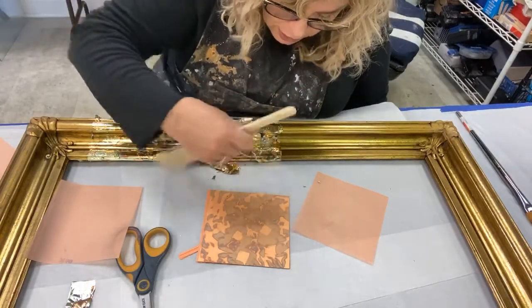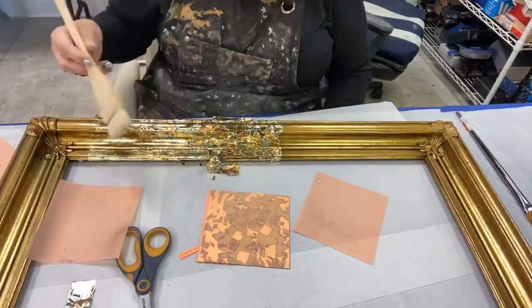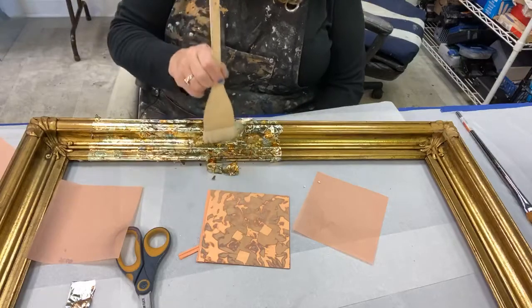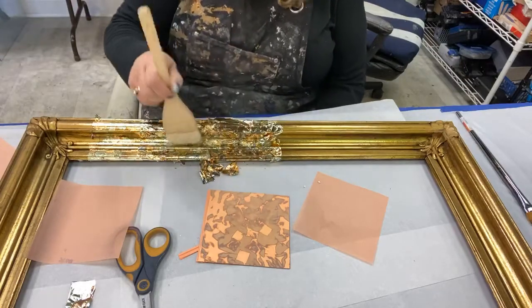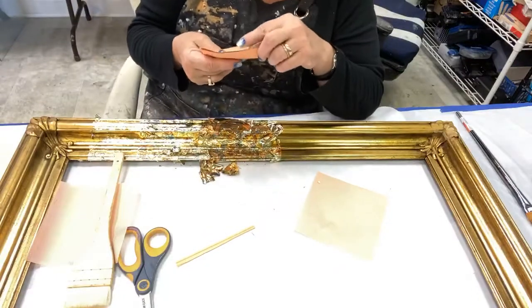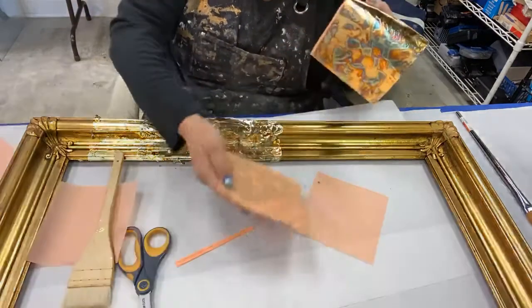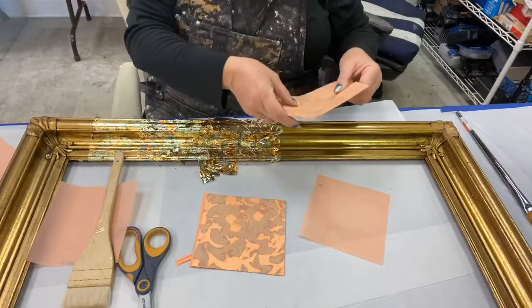So I'm double-leafing now to get into the detail. Double-leafing means I put two sheets of leaf on there. I've got my brush. If you don't have a gilder's mop, which many people don't, you can just use one of these little inexpensive rabbit fur brushes. I'm pushing it in. The reason that second leaf is there is the first leaf will crack as I'm tamping it down, and the second leaf covers the spots and goes into where I missed with the first piece because it cracked.